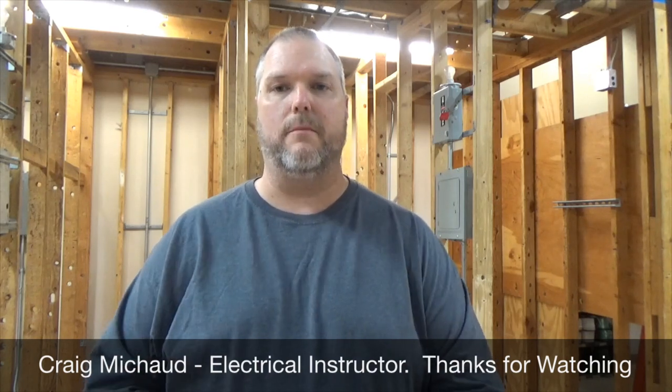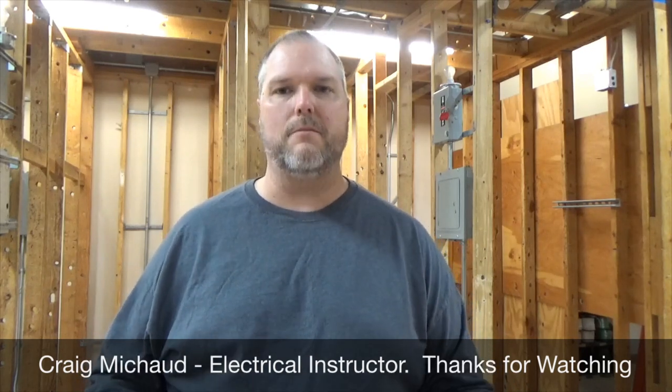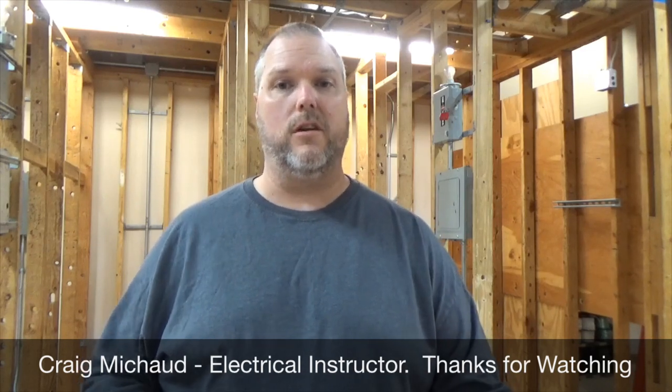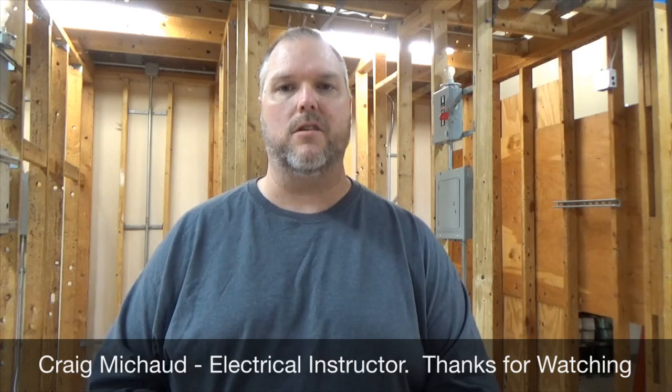We just did three here for this demonstration, but when you're pulling 15, 20, 30 wires at a time, sometimes it becomes a pain. My suggestion to you is I hope you took something from this and learned how to use the half hitch method in order to tie some THHN — or you can even use voice and data cable, fire alarm cable, any other types of cables. Any time you're trying to pull through a conduit.